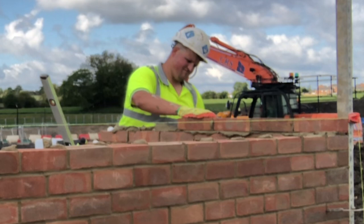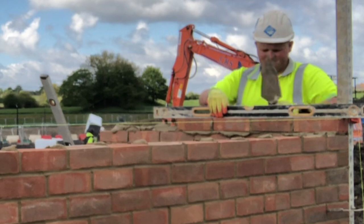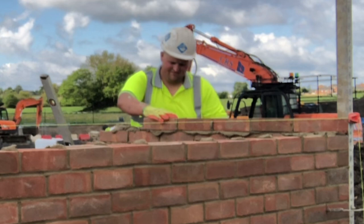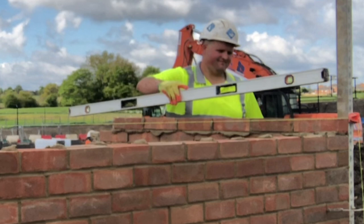Today I've got some footage — we're about one and a half days into this, probably one and a half short days into this garage, and I'll have it finished tomorrow. On this particular garage I managed to build it to about 22 courses, which I like to do. My main aim is to leave seven courses on top because a garage wall plate height is 29 courses. Seven sevens is 49, so it's 490 plus 35 equals 525 bricks — a few blocks and the wall plate to bed on. That's a nice day's work.